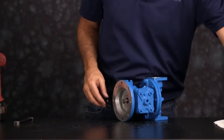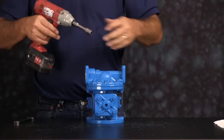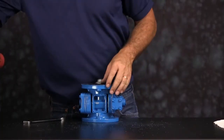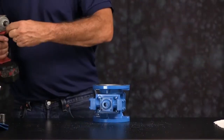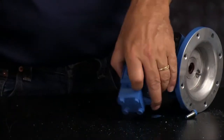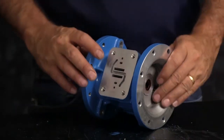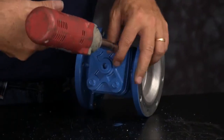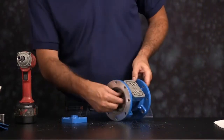In this case the assembly came off of the rod. Take off the other outer chamber. With the outer chamber set aside you can remove the diaphragm rod and assembly. Now we'll take off the main air valve assembly. You can discard the assembly and the gasket. Now we'll take off the air inlet cap. You want to retain the air inlet cap but you can discard the gasket, pilot valve, and the gasket below.